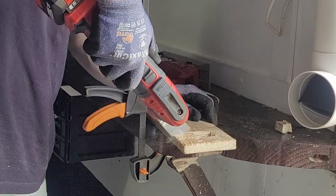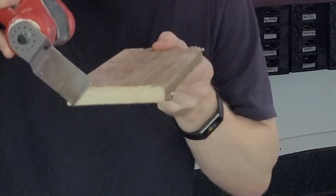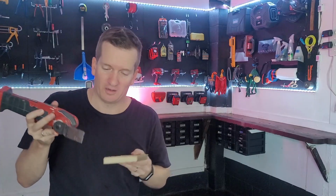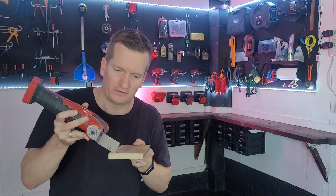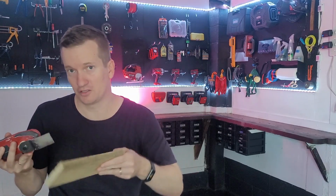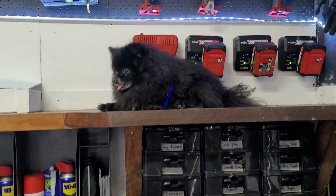And when you're cutting through, a big mistake that I personally used to make all the time was that I'd start off like this and then sort of get through, and then I'd sort of try and work the way through the entire depth as I made my way through. However, a more efficient way is to actually just do a very shallow cut, make it all the way across, and then once you've done that, just go a little bit deeper again, and then maybe a third or fourth time, just deeper again, and then deeper again. And so this is effort-wise, and also for protection of your blades-wise, the most efficient angle in order to cut through any material that you're trying to get through. And so that moves us on to the next part of this video, and that is the paint scraper.